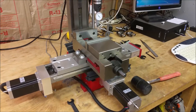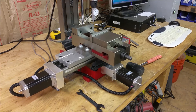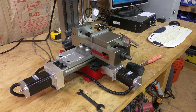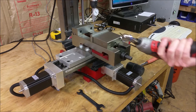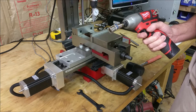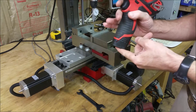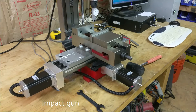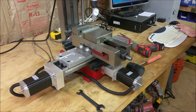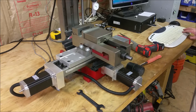So the tooling plate is in, I've got the vise in, and both of them have been trammed. Also, I got one of these sockets that I've seen other people doing — I think it's a tactical keychain type. NYC CNC had talked about this. I actually just put it on one of these 12-volt miniature drills here. This works pretty good because you can just tighten it up like this. So I'll get this out of here and turn it off to the side.